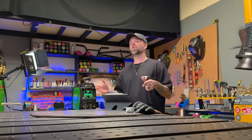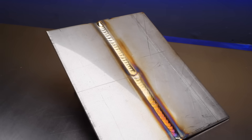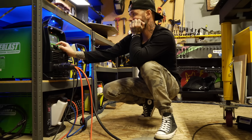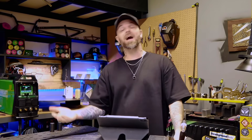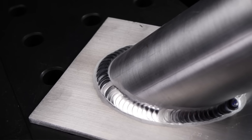They would end up working with more tube, pipe, stuff like that. So we started to structure the blueprint of what we were learning in this direction. We did get started with some of the plate joint exercises, but we put more emphasis on the butt joint exercise — this is a big pivot in the program. I'm going to use the Everlast Typhoon 230 here. This machine is an incredible bang for your buck and is capable of some really heavy duty welding. The butt joint is one of the most underrated exercises — it seems pretty simple, but when we learn the proper things with it, those skills transfer over to working on pipe joints with much more success, much quicker. From that point, we move on to pipe joints, coped pipe, and all kinds of other intricate work.